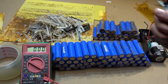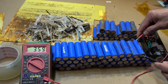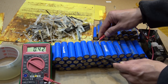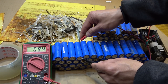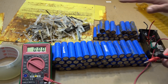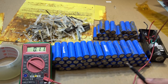I've got all of the cells out. There's a lot of hot glue, but for the most part it's quite easy to remove. Now let's see what voltage we get on these cells: 3.9, 3.9, 3.9, 3.9, 3.7, 4. So it seems like almost all of these are still good. We got two stacks here — the clean ones and the ones that are more corroded. Most of the corroded ones are on the top layer, and there are three layers on this battery pack, so they were somewhat protected from the water.